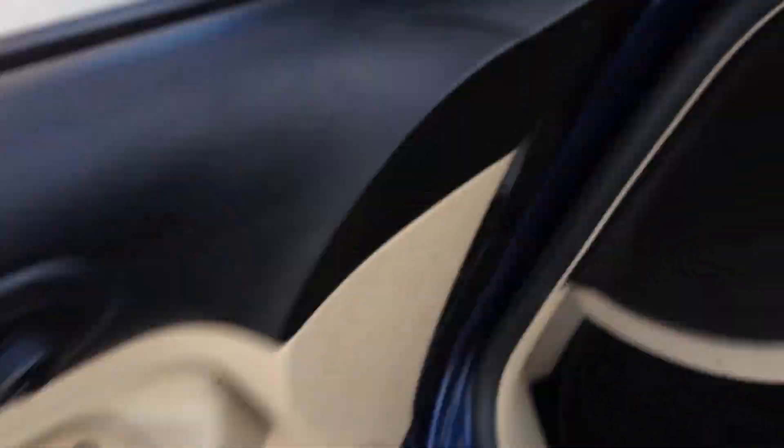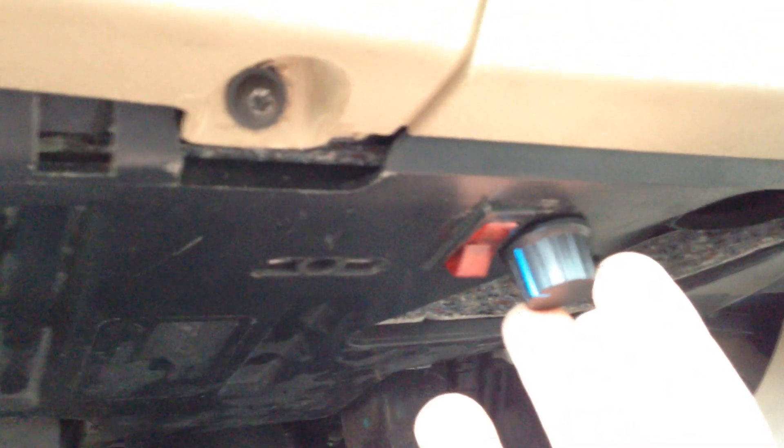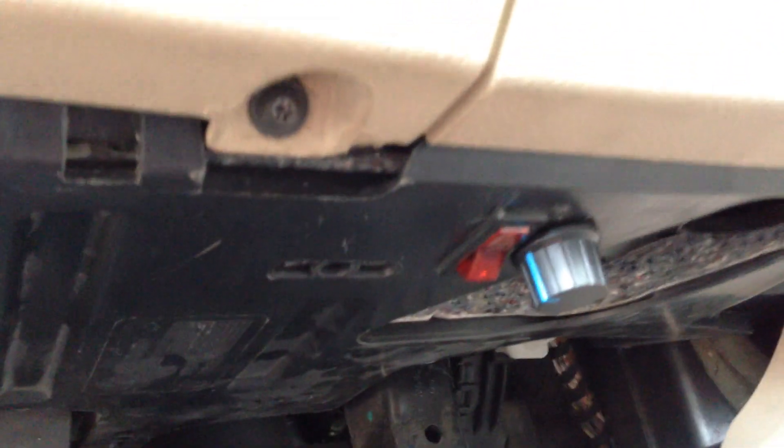On the bottom here, underneath — you saw before I just had a switch down here to turn the system on and off. Now under here I have the switch plus the potentiometer to control the amp draw voltage that the cell gets. So I can control my amps really easy as the water heats up and cools down. You can turn it up and down. And here's the switch to turn the system on and off completely.